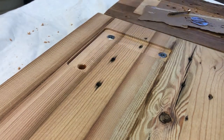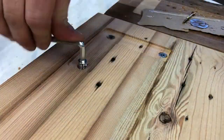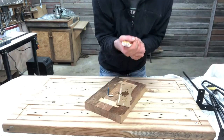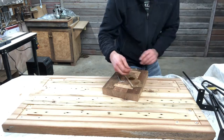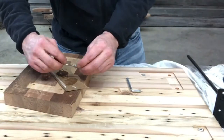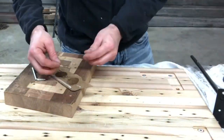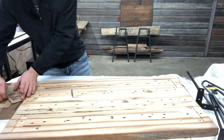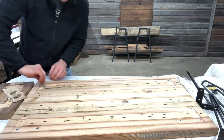I don't recommend using an impact driver. I see lots of guys doing that, but why — when you've gone this far — would you risk cracking that wood or putting it in sideways? I just go by hand and I'll continue going by hand because I know it works really well. These thread inserts have immense advantages: you can take the table down, move it, set it back up, and you're good to go. They're so easy to use. Once the threads are there you're not going to strip threads, and you get away from actually screwing right into the table. It's an excellent way to do it, and it's great if you resell them too.